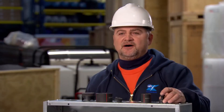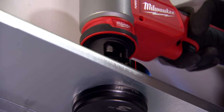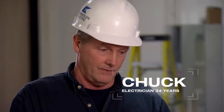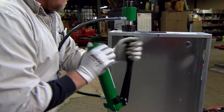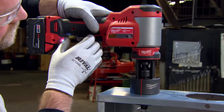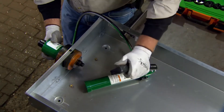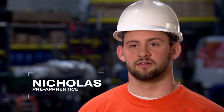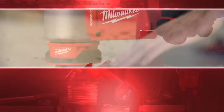It's just as easy to pop a half-inch hole as it is a four-inch hole, and the fact that it cuts through thick steel very easily and without much effort really impressed me. It's easier to cut them out versus the old knockout cutters with the pump — you've got to really pump hard to get it cut. The battery-powered Milwaukee is just awesome when it comes to cutting. With the battery, you're not lugging around the big hydraulic cylinder. On a job site, we're swapping batteries out all day long — with it being the same battery platform, we just grab it off the charger when we need to knock something out.